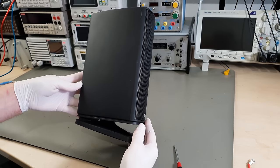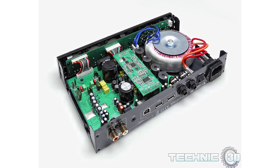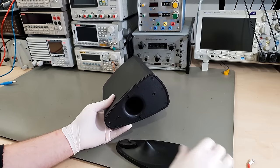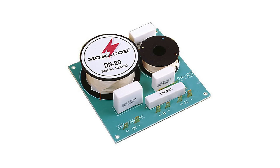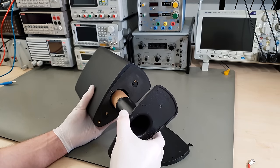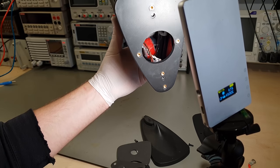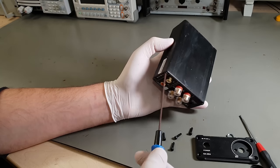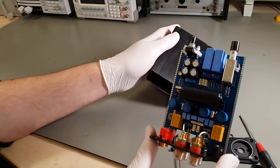My speakers are older Teufel hi-fi ones. Originally these were bundled with a USB audio interface and amplifier box. Quite a prominent noise came from that, so it became one of my first electronic modifications. Hey, no judging — I was a teenager interested only in World of Warcraft back then. I made passive crossovers to protect the little tweeters from the high-amplitude signals intended for the woofers, no calculations or anything. I was delighted to find a voluminous space-reflex room to shove them into, and operated them with one of these decent quality class D amplifiers. That worked a treat for about 10 years.